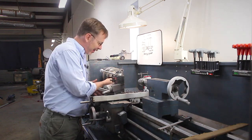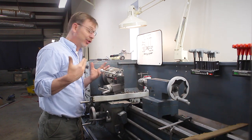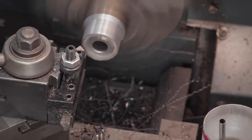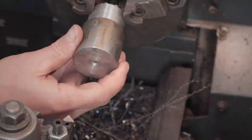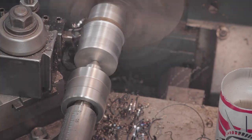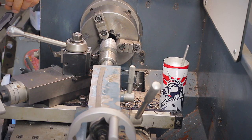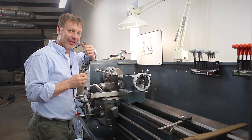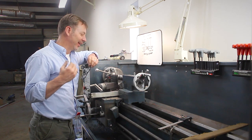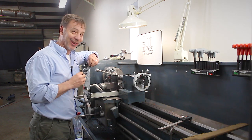What's great is the diameter on this is not critical — it's just where do you want it to be. You can have it too large, but you don't want to go too small, and it doesn't have to be dead on. This is going to take a while; there's a lot of material to take off to get it down to size. I'm used to using the bigger lathe where I'm doing quarter inch, half inch cuts with carbide inserts, so let's just say it's going to take me a lot longer than I really planned.